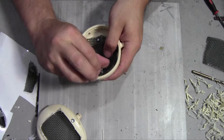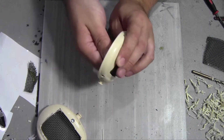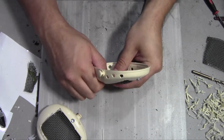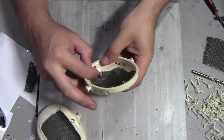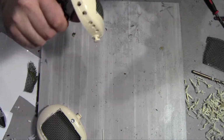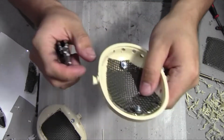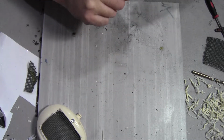All right, and we're just going to screw these on. Additionally, you don't have to worry about any thread lock or Loctite or thread sealant on here, because the hot glue gun is going to act to prevent these bolts from working their way out. So I'm going to put this on here, grab the multi-tool, grab onto here, and give it a bit of extra tension. I want to be very careful not to over tighten these, because it will crack this. Just want to get it on there nice and secure.